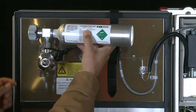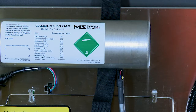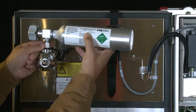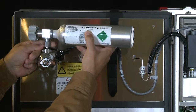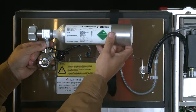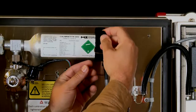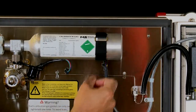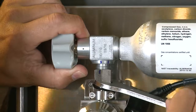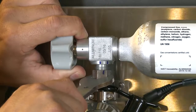Connect the new cylinder to the regulator inlet. Make sure that the bottom of the cylinder is ready to be strapped in place. Tighten the nut finger tight onto the new cylinder, ensuring that there is no play between the cylinder and the stem. You may have to move the cylinder slightly to ensure proper finger tightness. Secure the cylinder using the strap, then tighten the nut between one-quarter and three-eighths of a turn. This will deform the PCTFE gasket to form a leak-tight seal.